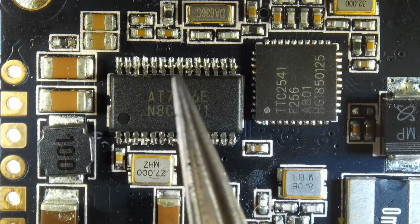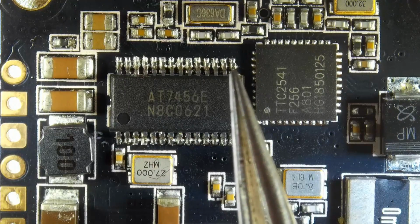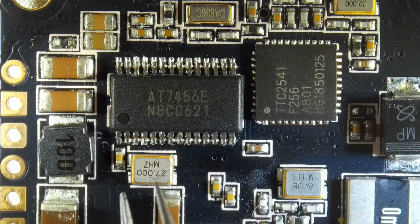So yeah, I don't want to lose you. It's pin 22 that is video in, counting from here, which would be starting at 15. This would be 15 here. So count till you go to 22. And I think that's it, guys. So let me go back to the oscilloscope. Let's go ahead and take a look at it, and then we'll continue from there, guys.